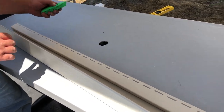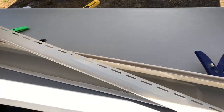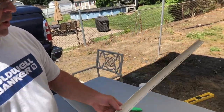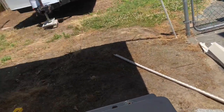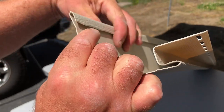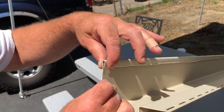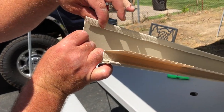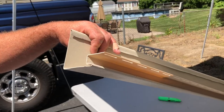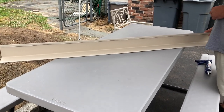It doesn't have to be perfect but it has to be close enough so that the existing channel works. This is what we discarded — like I said, I was cutting off that existing part of the J. We discard that, and what we're left with — I'm going to do the same thing on the other side — is this U, as you can see here — the upside-down U that is going to attach to the existing J-channel on the house. You don't need to see me cut again on the other side, and then I'll show you how we attach.